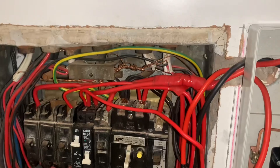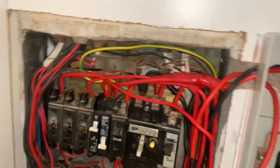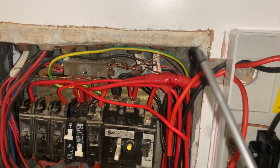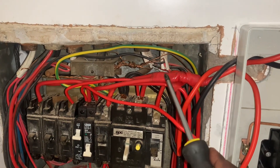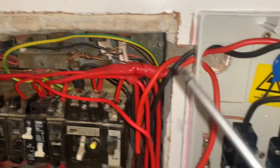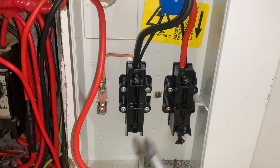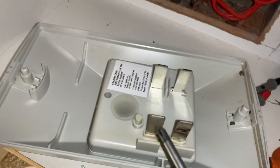So the way I understand it is that we have our main 220V coming in from here — that's coming from outside, from the main transformer, coming in here. Then it passes through these contacts over here, which are connected to the back of these, which are basically switches.